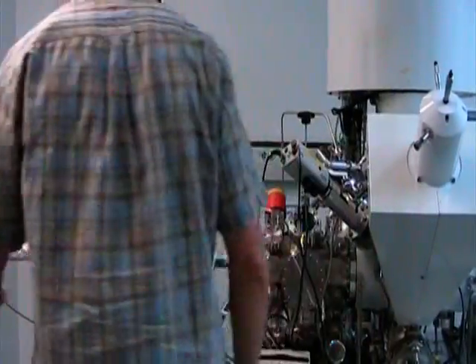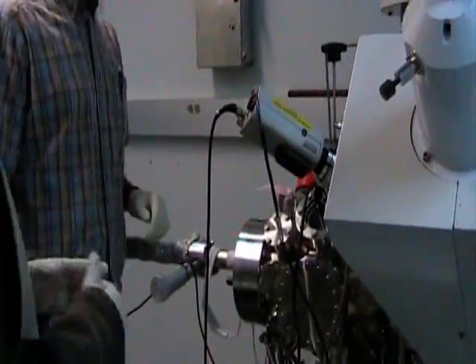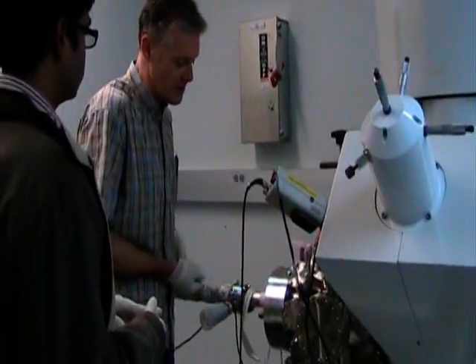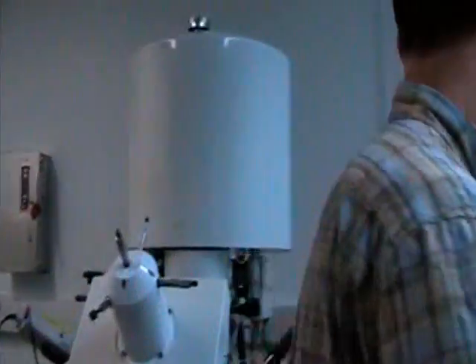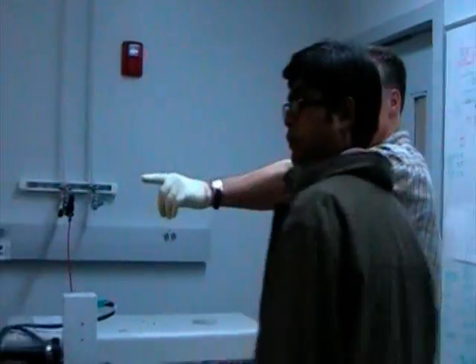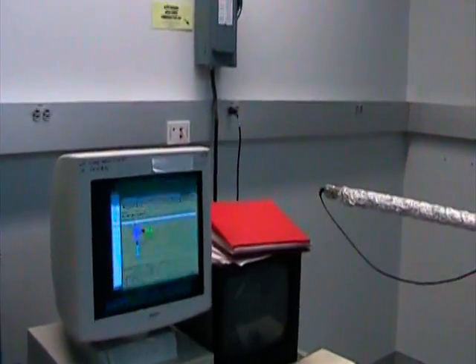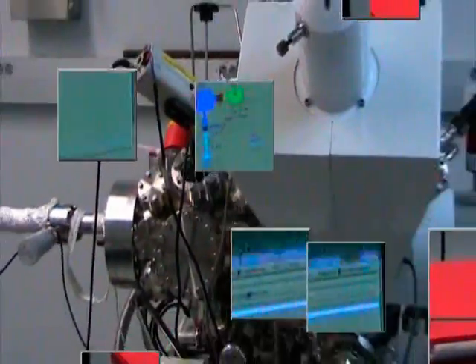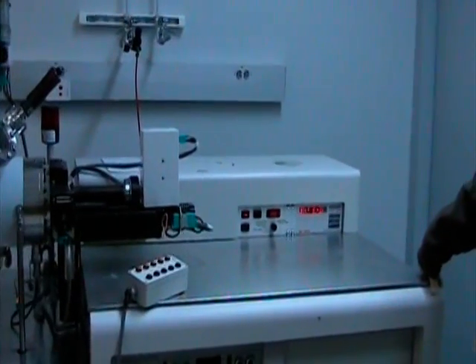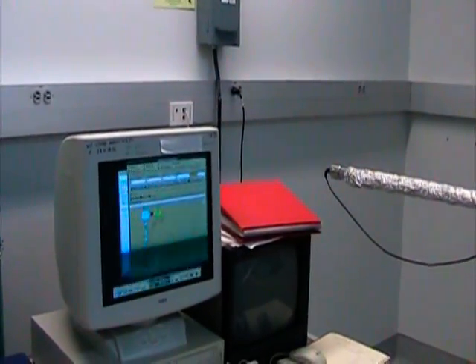Normally you would get a stand here. It's easiest to give it a little push, just supporting it and letting it catch, so that the vacuum can catch it. When you're here by yourself, you can see that this is dark blue — the area where we just put the sample is going to show on the computer screen as dark blue. That's the roughing line, channel 3. When that gets down to 1 torr, the dark blue area turns light blue. Now it's just turned light blue, so the roughing line is down below 1 torr — you can be confident it's pumping properly and walk out and leave it.